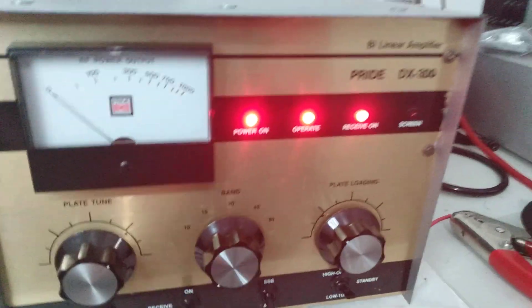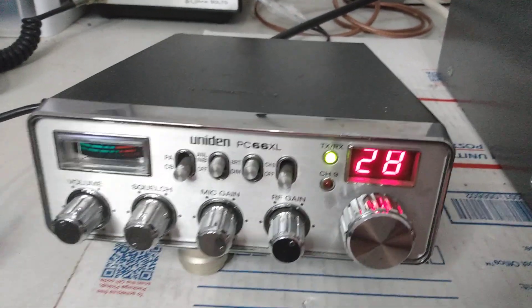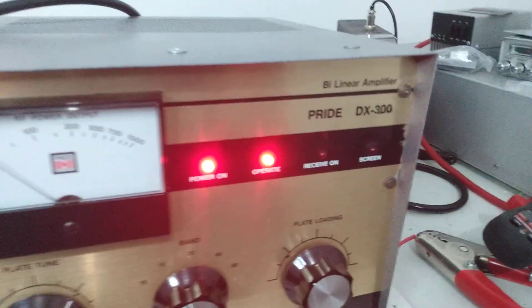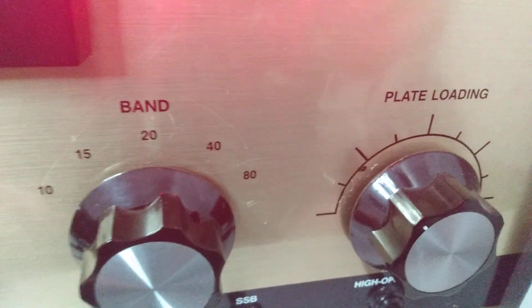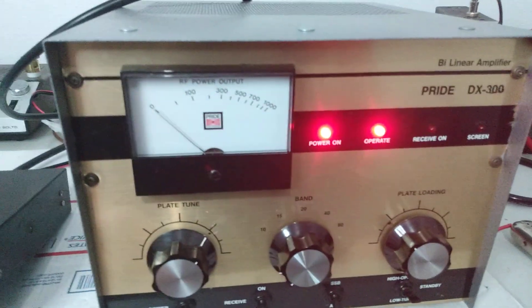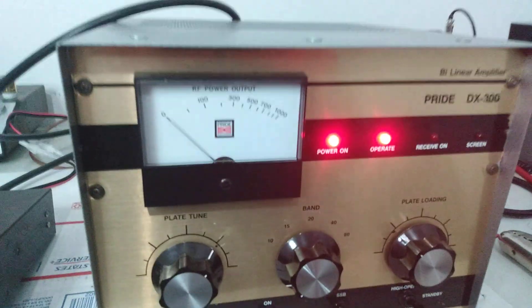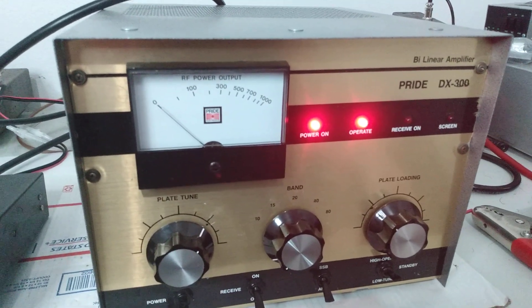The preamp does work. Obviously the light's on, but we'll listen to it here. That's the preamp on and off — you can tell that it does work. It's got pre-marks on the front for where to tune it. I have tuned it for peak output. If I tuned it for average it would do a little bit more average, but I have tuned it for PEP. So when we watch it on the watt meter, just know that it is tuned for peak. You can tune them for average if you want to, but it is tuned for peak.